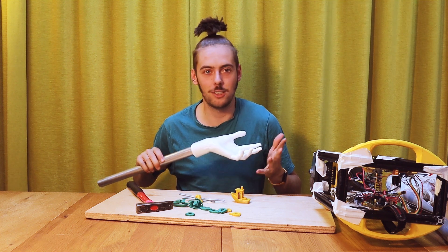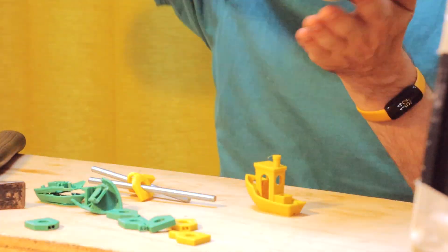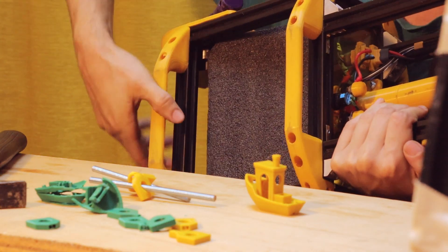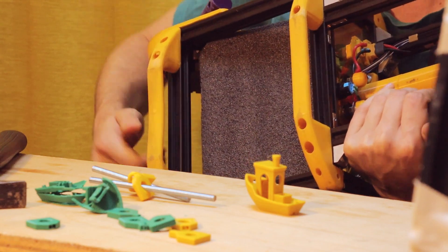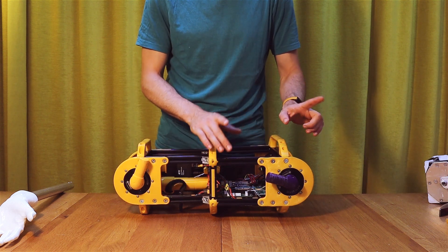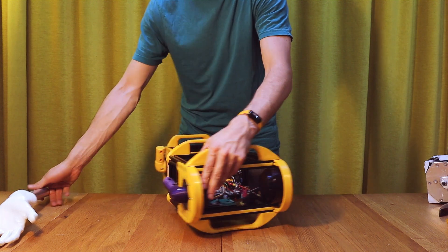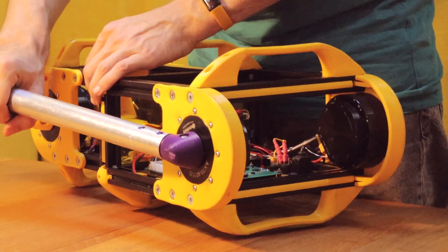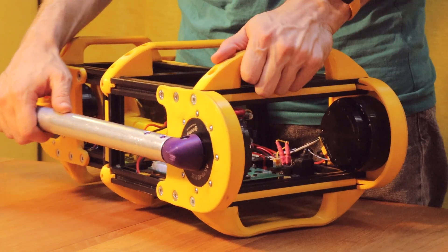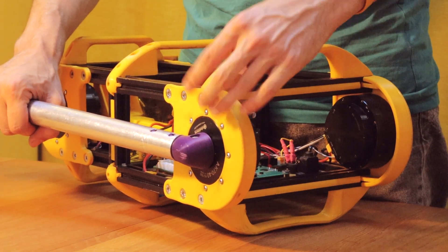When I discovered this material, I realized it's a super material and I can use it for all of these parts. Now on my new robot, all of the handles are made out of TPU, which means they're all a little bit flexible. That's not necessarily a bad thing because it's still rigid enough to be functional, but mostly it never ever breaks. As I was designing with it more and more, I realized the flexibility is also useful mechanically. For example, there's a motor underneath with a gearbox inside, and sometimes there's an unintended sideways load on the motor which risks breaking the gearbox. Because I made the part flexible, the motor can move around and the stress is caught by the TPU rather than the gearbox.